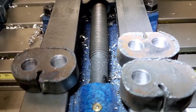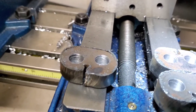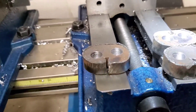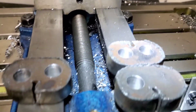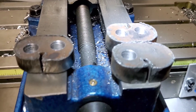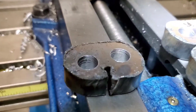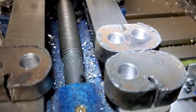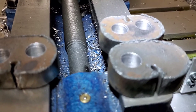I started off with 6 inches per minute at 50% feed, and the very first hole I drilled I actually thought was pretty good. Then I decided to go 100%, dropped it to 3 inches per minute — that just seemed like it was pushing in a little bit too hard. I do a lot of drill pressing for these same holes and the same steel, and I know about how hard you can push in on it.